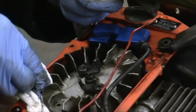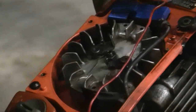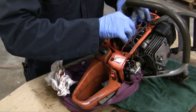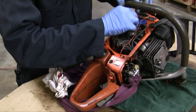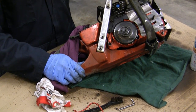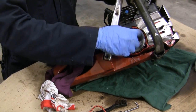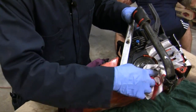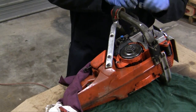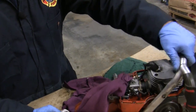While I'm here I'll wipe things down a bit more and inspect to see that everything looks about right. This is a good time to check all my nuts and bolts and make sure they're tight — these are things we don't see on a daily check, so now is the right time to inspect. Something I can also check on this side is to make sure my chain brake is actually working: I see that the sprocket spins freely, then I bump the chain brake and it doesn't turn, so I know that's working properly. Once that's done, my saw is clean and I can set this aside and move on to the other components.